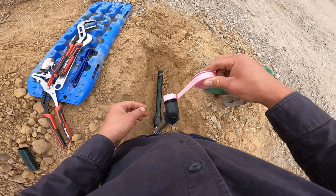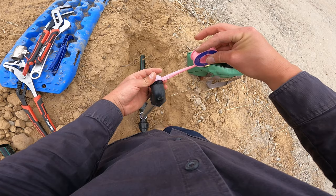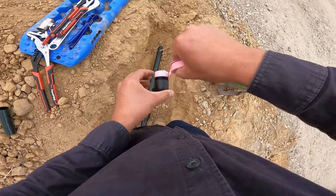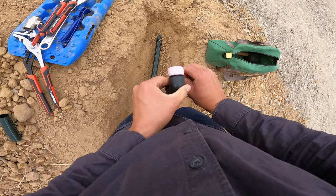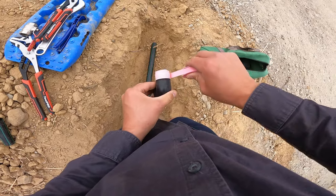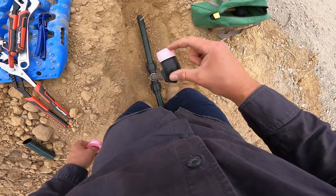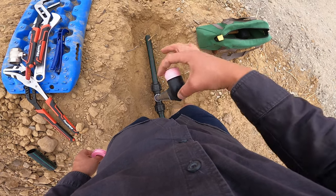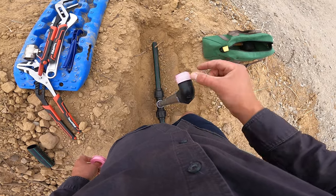Here's a tip I learned from YouTube when using plumber's tape: notice how we're winding it clockwise towards us. Instead of holding the roll outward, hold the roll so it helps maintain tension. You can't emphasize enough the importance of putting enough pressure on the tape, otherwise it has a tendency to twist with whatever fitting is going on it — it'll just twist along the thread. Nice and tight is the way to go. I start at the end, then overlap a bit more toward the tip to make it thicker there so the thread gets a tighter, more secure seal.